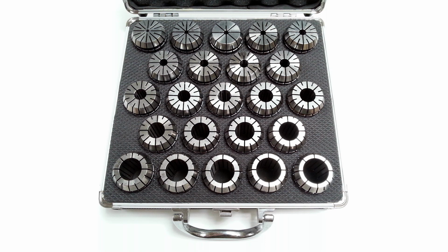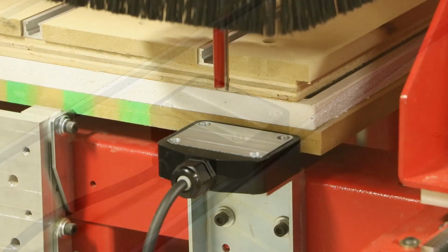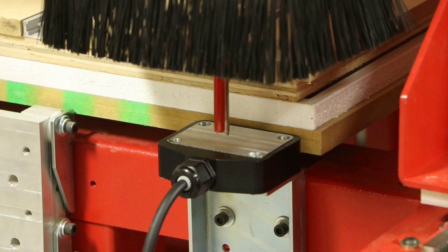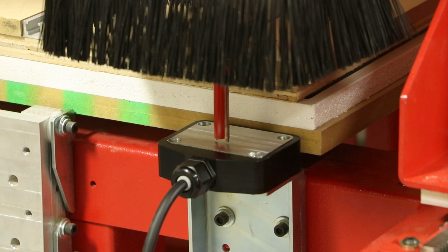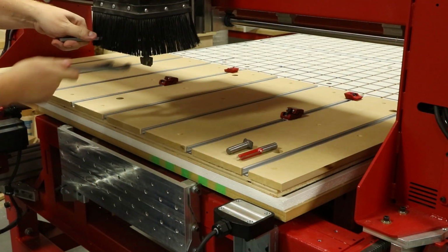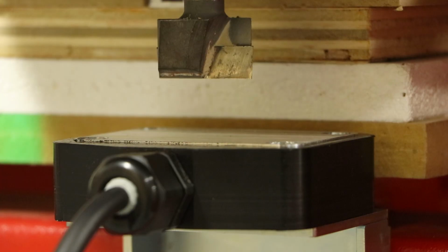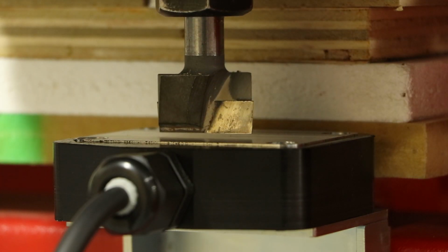9/16 inch shank diameters. The next feature is another Legacy customer favorite, the Smart Tool Touchpad. It is an operator's best friend during any tool setup routine. The Smart Tool can automate tool touch-off sequences for both flat and turn components. But instead of limiting the operator to a single tool touch per program like other tool touch-offs, Legacy's Smart Tool can measure unlimited tools during a program.